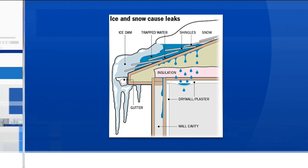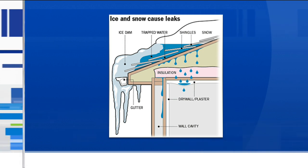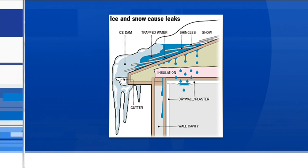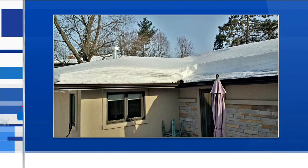As soon as it gets past the outside wall, where there is no attic below it, it freezes, and we get that ice damming. And that will happen anywhere from 0 to -10. So it can, and we've seen those temperatures that are coming. So it freezes up, you get the ice dam, the water backs up, gets under the shingles, and then you've got water in the house.